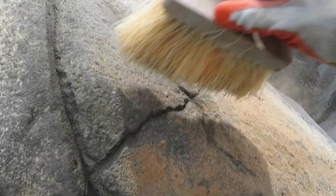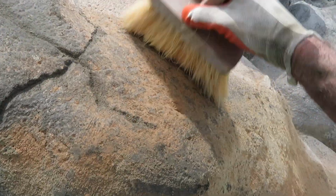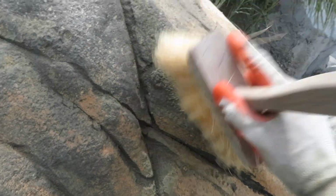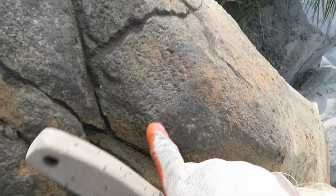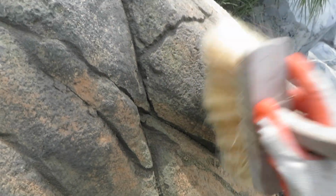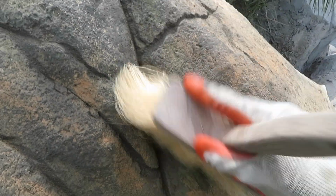You can stipple. If you hit a really wet patch, I try to get rid of the ripple that you sometimes see, sort of like waves in the ocean or in the lake, from the spray pattern when you blow on the mortar mix. So you can see it's a little bit moist right there, and so that'd be a place to just give yourself a little stippling.